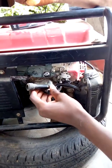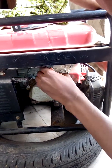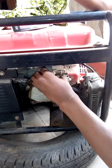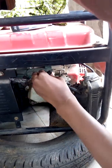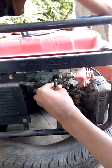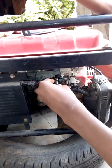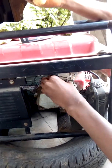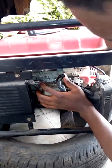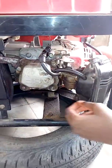Now this is the spark plug cap — very essential. You fix the spark plug cap over the spark plug and make sure it goes in. There you go, you've fixed the spark plug. That's easy to do, so you don't need any technician. Most problems with your generator can only come from the spark plug, the fuel tap, or the engine oil.